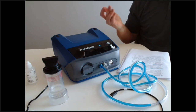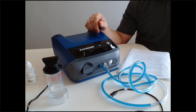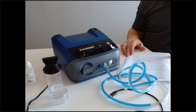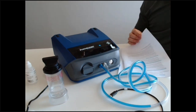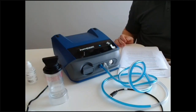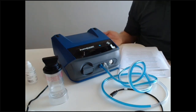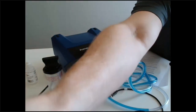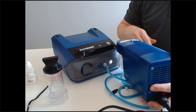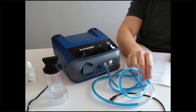If you're failing the minimum particle check — which is the first part of the daily check and the first part of a fit test — you're most likely going to need a particle generator. Positioning of the particle generator is important. You want to get an idea of the room you're testing in. Usually it goes fairly close to the PortaCount — not necessarily right next to it, but about three feet. Marty has also suggested using a small fan, because the air from the particle generator goes straight up, and the fan can help blow it toward the ambient tubing inlet.